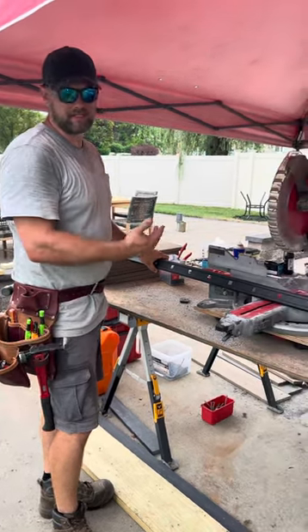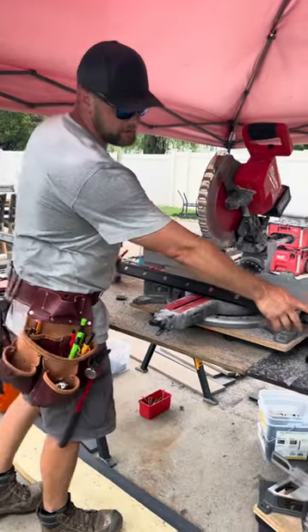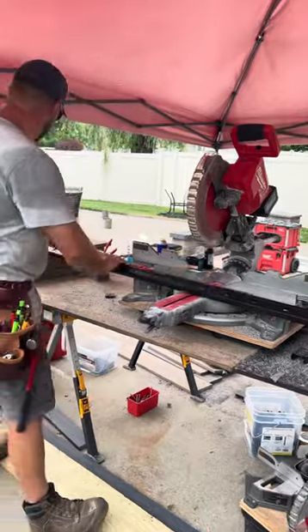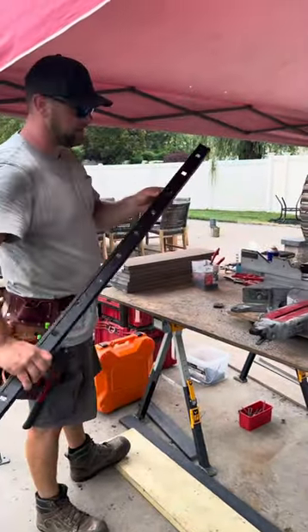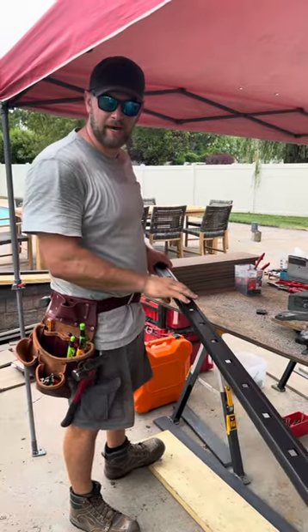This is the bottom of the top rail. You can't just measure it and cut it because, again, the balusters have to line up. As you can see, I have a line right here and on this side I have a line right there. I must cut on those lines to make sure they correspond and work properly with the bottom rail.